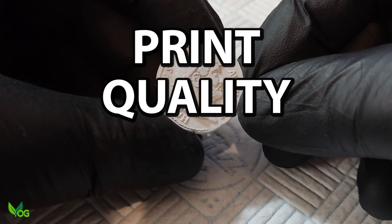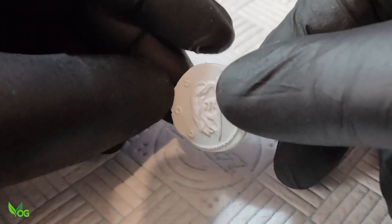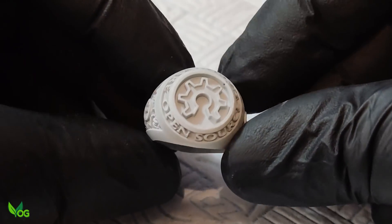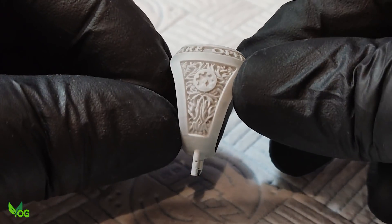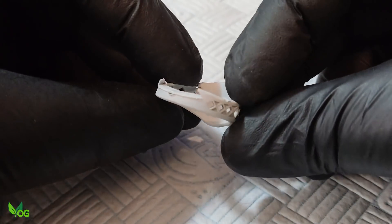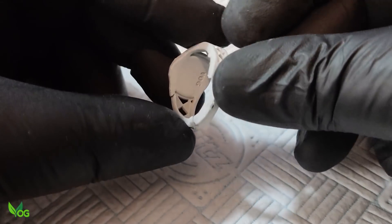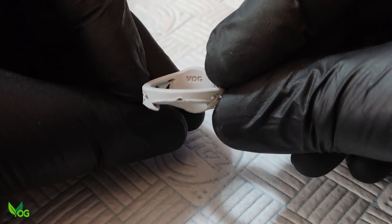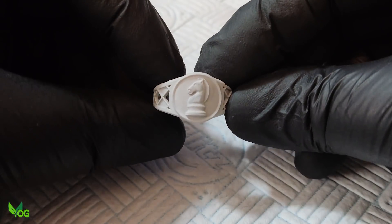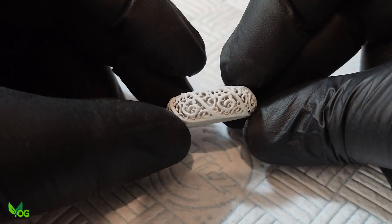Now the printing quality bothered me. In one respect I was absolutely delighted — I thought the resulting details were excellent. Genuinely, these are the best prints I've ever achieved with any BlueCast resin. However, there were failures and the fault for those was mine — most of my supports were 0.25mm at contact point and not the recommended 0.4mm. But what bothers me is that large supports can spoil the detail on a print, which is after all why we use thin supports. So if you can't live with thicker than average supports, X1 isn't for you.